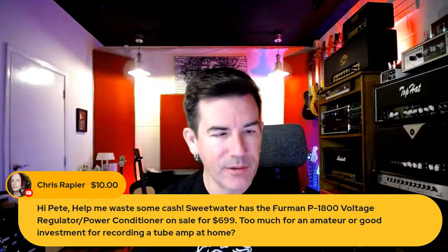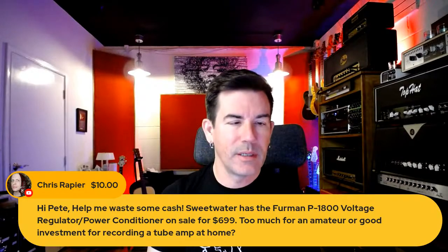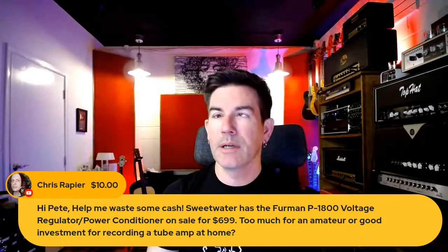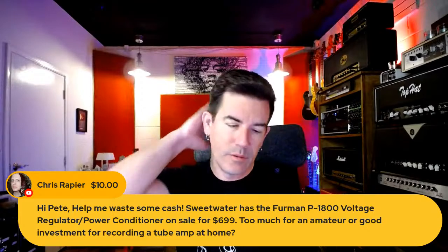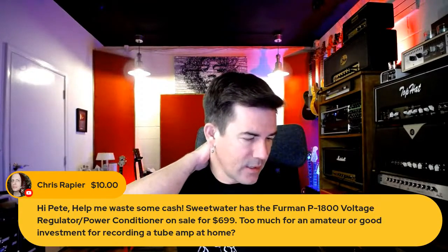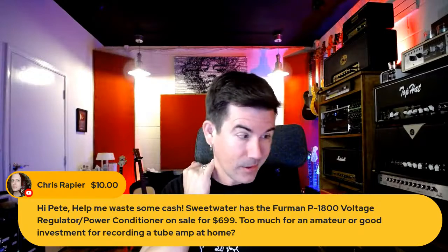I don't know if it's going to make your stuff sound better, but I do believe in the brown box thing and variacs and stuff for vintage Marshalls. I think it's good to have certain old tube amps see around 110, and you're already above that if you're doing 117. I talk to a lot of people who say, oh, my house is like 125.